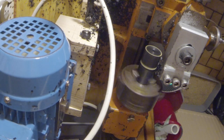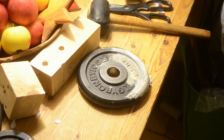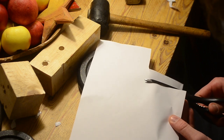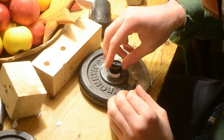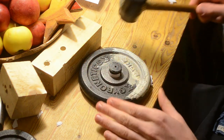From now on, let's call the workpiece the adapter. If the adapter is slightly smaller than the hole, I take a piece of paper and arrange it in the plate's hole. Now it's time that the adapter gets a firm punch once or twice with a sensitive hammer.